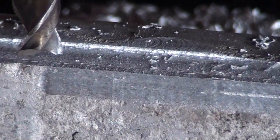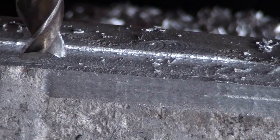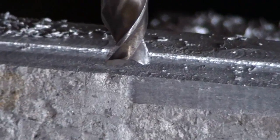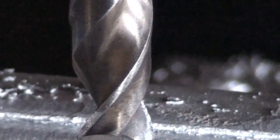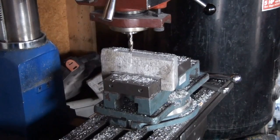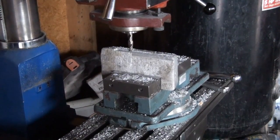That's the side milling there — it's not the most awesome but hey, it's decent, it gets the job done. If you're just trying to mow down a little bit of that material and get it to a nice clean finish, that's the way to do it. Not bad for a broken drill bit. If I were to do some relief angles to the side of the drill bit, I'm sure I could get some really good side milling. So don't throw away those drill bits — sometimes one man's junk is another man's treasure. That's it for this video, that's how to make your own end mills, thanks for watching.